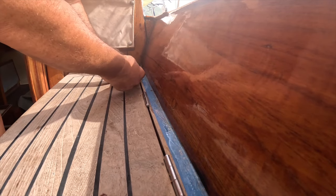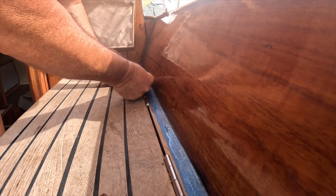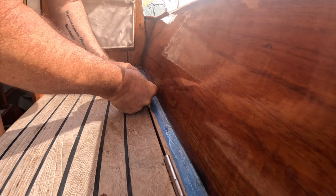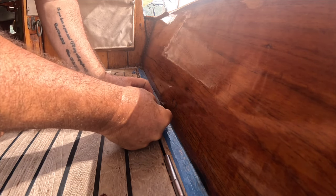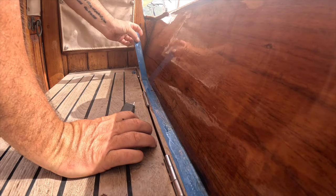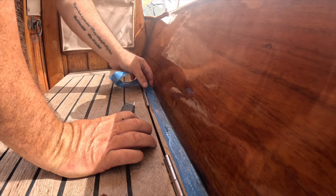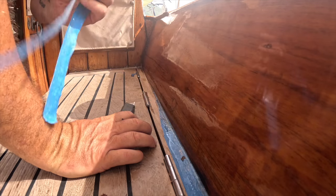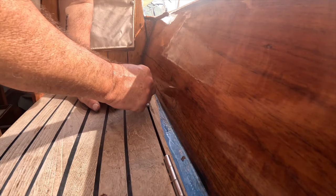Just a little tip for you: if you put on several layers of epoxy, varnish, everything else, you're probably better off re-masking each day rather than leaving the tape on. Because once you get several layers of tape on and it's been on there a few days, it ain't coming off.